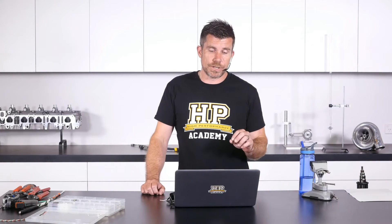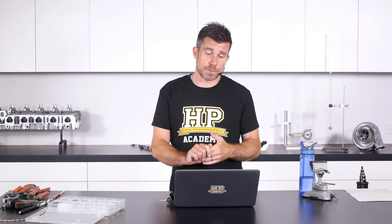This is a really good question Dean, and we actually had some pretty big debate just recently on one of our Facebook posts. In the automotive world it is essential when we are using shielded cable to only ground that shield at one end — generally this will be done at the ECU header plug.